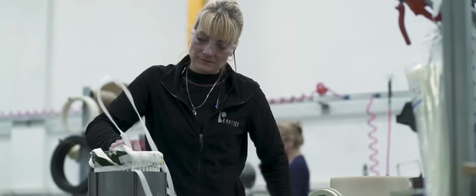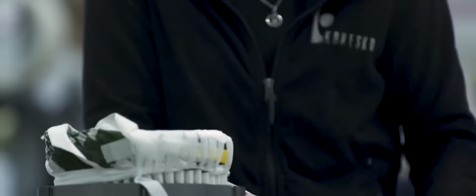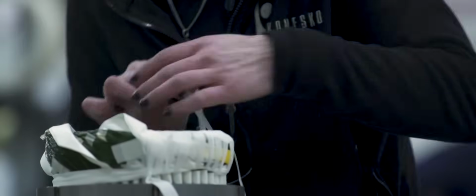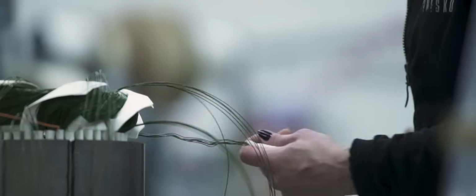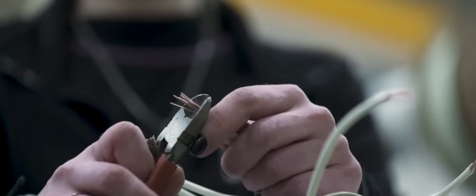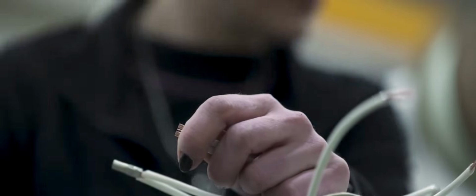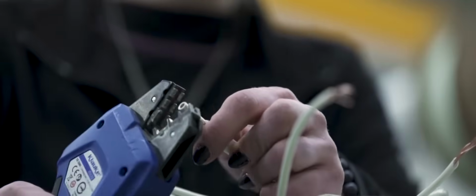Finally, all the necessary cables are attached and the stator is laced. That is done to secure the field coil ends to avoid any involuntary movement and vibration when the motor is operating. Depending on the size of the stator, the whole winding process takes anywhere from 2 hours to 2 weeks to complete.